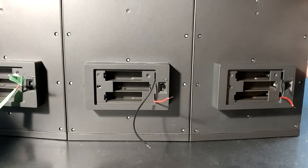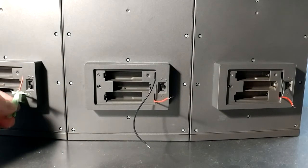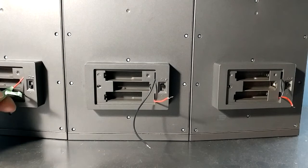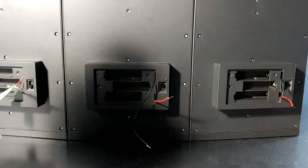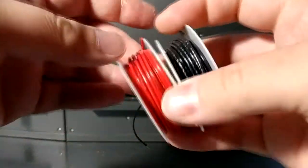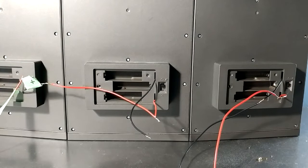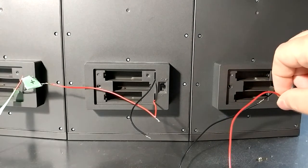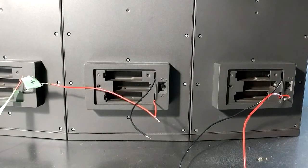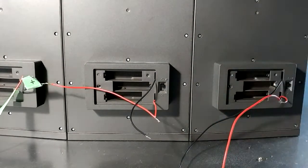I might as well put those together. I'm going to try and attach these — it looks like I wired these ones backwards because I've labeled this black one plus and the other one minus. I did these months ago before I got this one in, so I don't remember, but I guess I left myself a little clue that I'd goofed. So what I'll do is just wire these together — I've got some hookup wire here, red and black, so I'll swap it for that one and do it correctly. I'll just pull off some extra links and solder that together. I put those hookup wires onto those leads. The ones coming out are very delicate — I wish I'd used something else. I took these off some battery leads and this wire is actually stronger, but that's okay, we'll try to make it work.